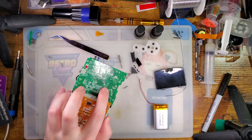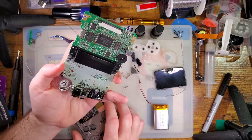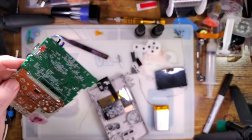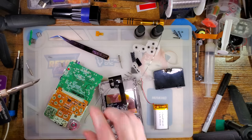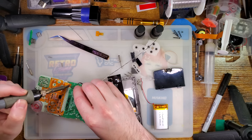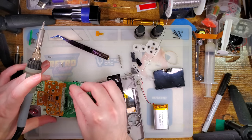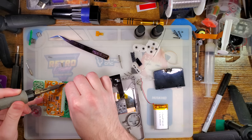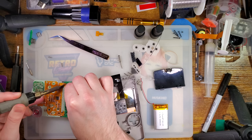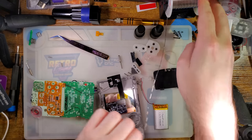Previously I used the two vias up here for clean wiring, but now that the button board is installed I'm just going to use the solder points right on the button board. One thing to keep in mind — on my specific button board the labels for start and select are backwards. I don't think it even matters for this kit, but this wire goes to start so I'll solder it to the one labeled select, and the select wire goes to the one labeled start. This is only because my specific button board has the incorrect labels.